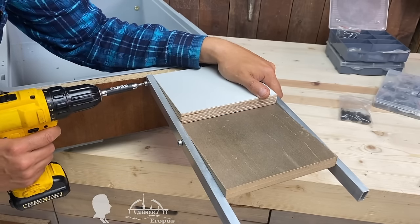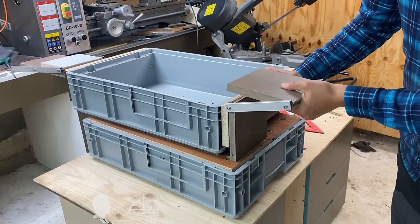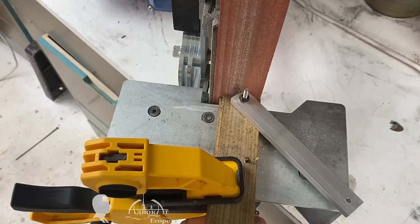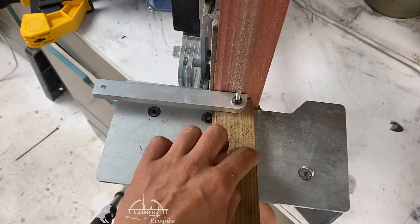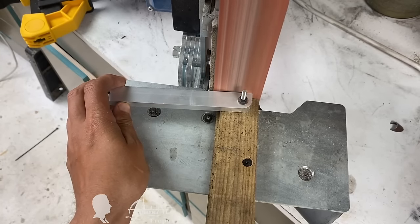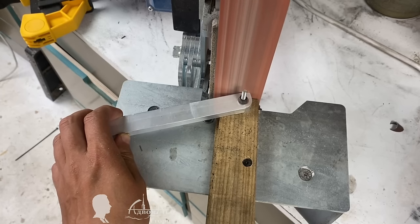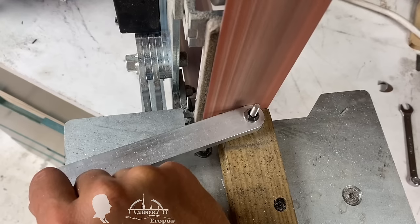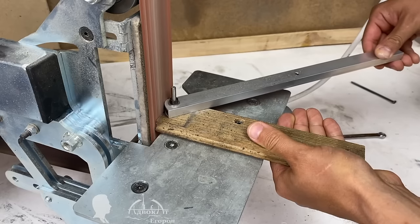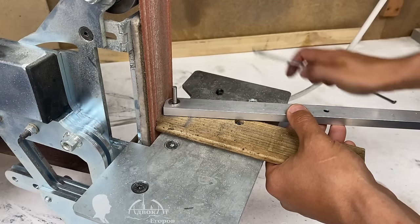The fitting of aluminum hinges showed that with the chosen method of fastening, the corners of the aluminum profile will inevitably obstruct the free movement of the module when assembled — so the obstructing angles need to be rounded. Using ready-made holes and a simple jig, this can be done quickly on a grinder by rotating the profile around the jig's axis. Note that I prudently didn't grind all angles — the four left corners will serve as limiters for the pantograph's movement. If you don't have a grinder, you can achieve the same result on a drill press using a sanding drum attachment.